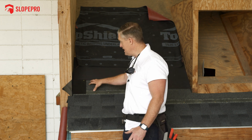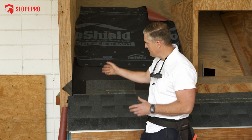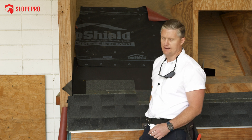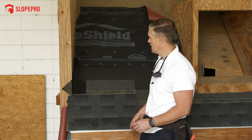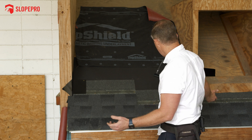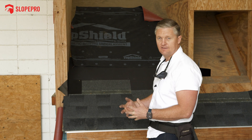You're only ever getting the amount of watershed on any individual piece of metal for each course of shingles, and then it's just running out on top. That's why you break it into steps all the way up instead of doing one solid piece. Is it easier, faster, and cheaper to run one solid piece? It absolutely is. But will that give you a good roof for the entire service life of a shingle? It will not. So we're going to step flash everything. I'll install a couple of pieces here and also come over and install a couple over there, because we have to do what's called an end wall flashing on this side - we'll talk about that detail next.